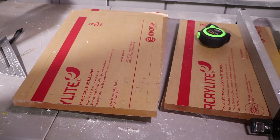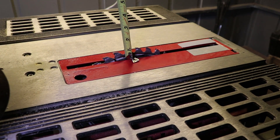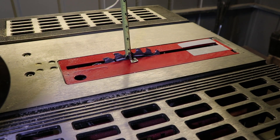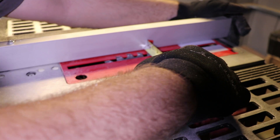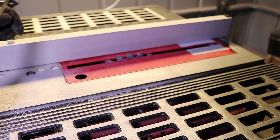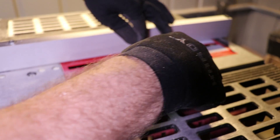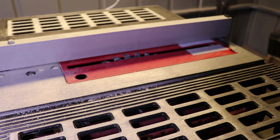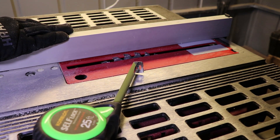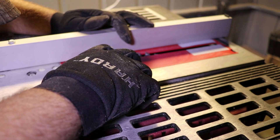Start cutting and trimming. There's one inch - we want half inch. Put on our handy jigger. When you do this you want to measure to the outside of the blade - the outside of the blade right here. You want to measure just to the outside of the blade because you've got to remember the thickness you're going to take off with the blade as well. Make sure she's all nice and square - measure twice, cut once.